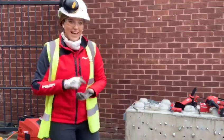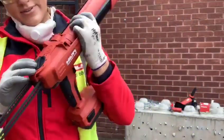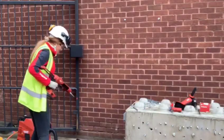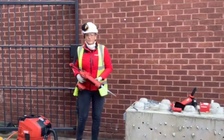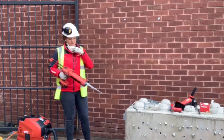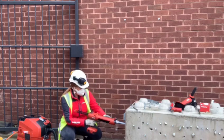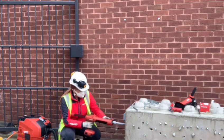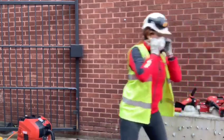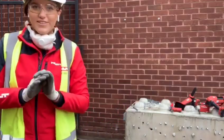Now I'm going to use the resin with the HDE500, preset to one plus two like it said on the app. There is no need to clean out the hole because we used the hollow drill bit — it's virtually dust-free, and that's again part of the Hilti Safe Set Solution, which saves time on site. That was the resin dispenser — you do not need to blow out the hole when using a hollow drill bit.